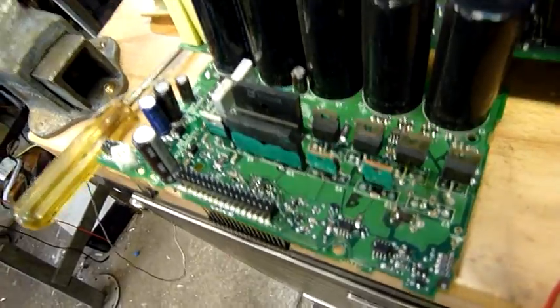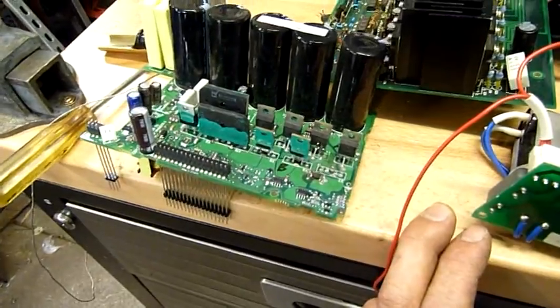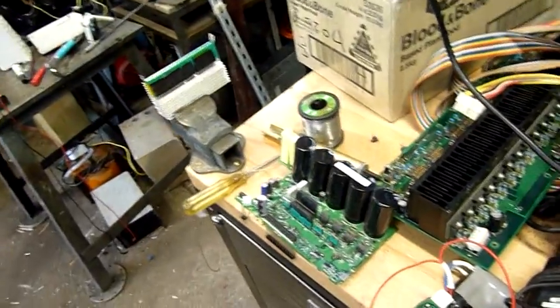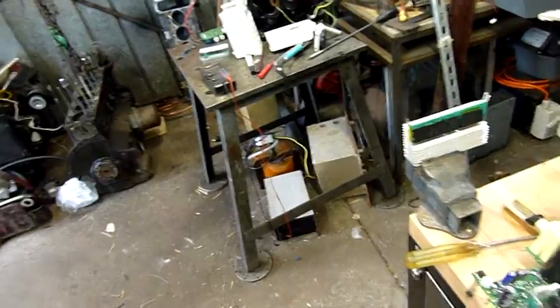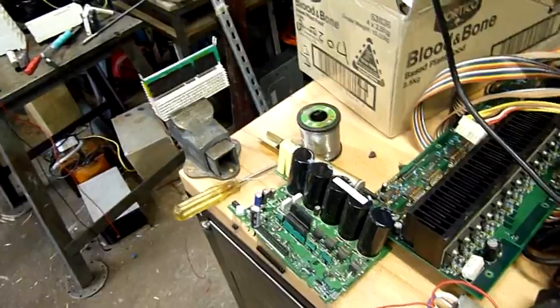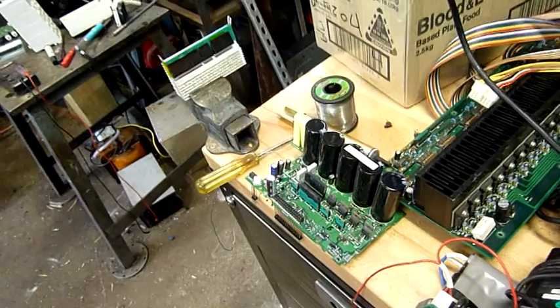Everything else looks okay, so it's not too hard to do. I'll look up the part and what's comparable — I'm not sure what I've got floating around that'll work. I don't have any other dead drives of this kind. I've got a Danfoss one down there, which is the smallest I've got, but I'm guessing that'll have a multi-pack IGBT brick — they typically do. These cheaper ones seem to run individuals. Anyway, I'll have a poke around with a soldering iron, remove that damaged one and just see what else comes up.